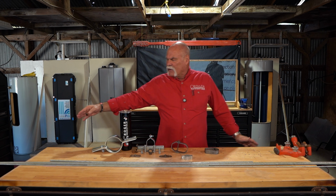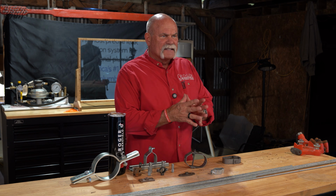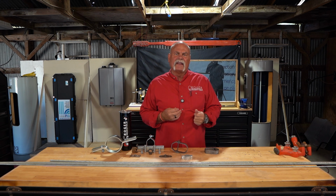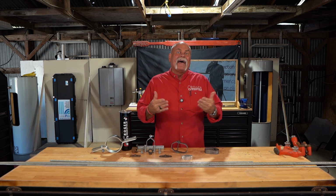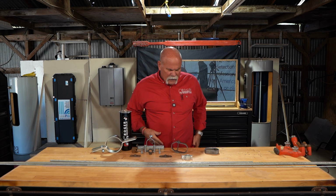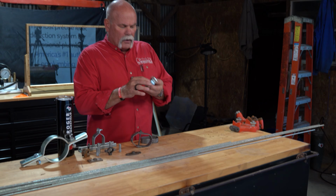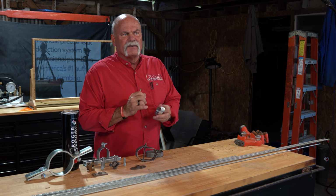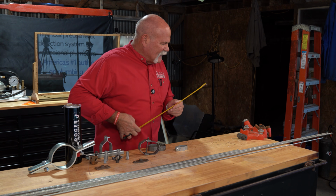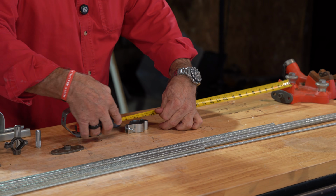And you know that from the floor to the ceiling, and we'll call that right there the ceiling, 10 feet. All right? So we're going to look at this. How would we set it if the pipe was at, say, 8 foot bottom of pipe? So we're going to make it real easy to begin with. So what we would do is we would say, okay, if this is 10 feet, we know that we want the bottom inside edge of this at 8 feet. So that's just simple math. That's an easy 2 foot drop from the ceiling.